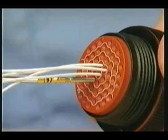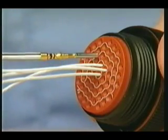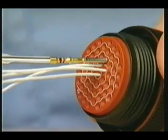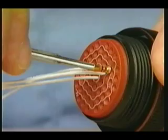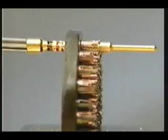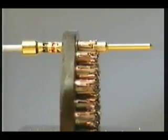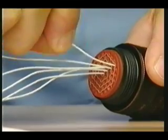Find the proper hole by counting along the trace line, keeping the tool and contact perpendicular to the grommet. Smoothly push the contact straight into the center of the hole. Push until the contact is firmly seated. You'll probably hear a click that signals the opening and closing of the retainer fingers. Give the wire a light tug to confirm retention.